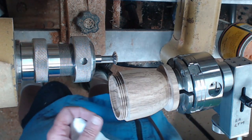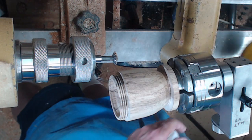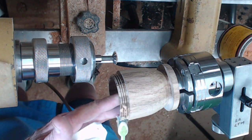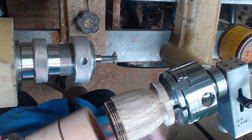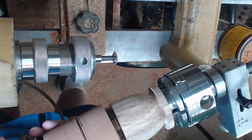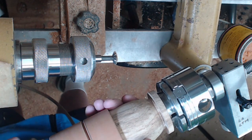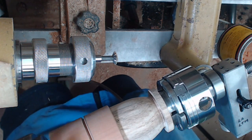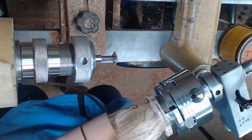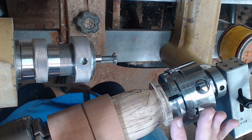The threads look like they're just about to fit, so rather than cut them any deeper, I took some 400-grit and just slightly rubbed over the crest a little bit. Now I'm going to use just a little bit of paste wax on both sets of threads and see how close we're getting to a perfect fit. Here comes the test — I don't want to cross-thread these. Perfect — I've got a nice flush fit all the way around, which means we've got our threads parallel with the face, so everything is copacetic. Now all I've got to do is finish turning both the top and bottom and add some decoration.